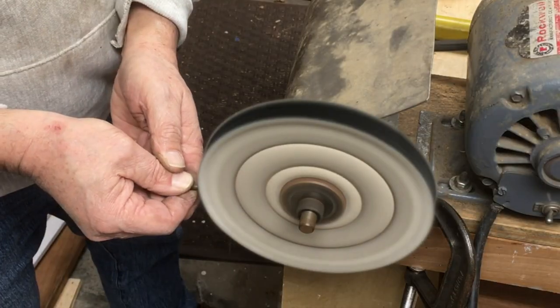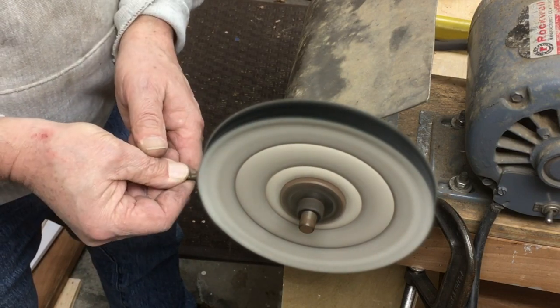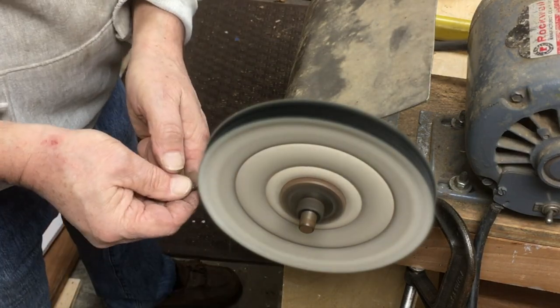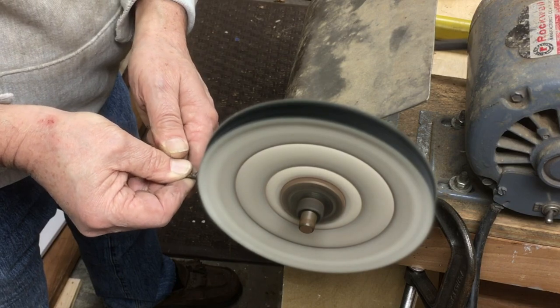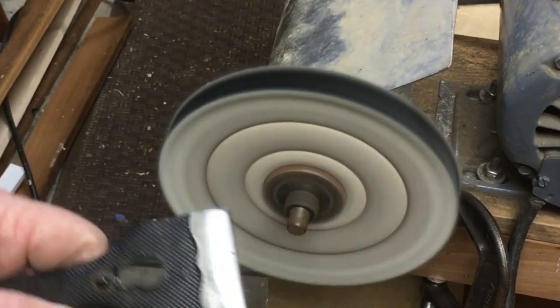But there's the screw that holds the knob. Again, you could get a mirror finish on that. I got a mirror finish on the two little screws that hold the frog to the body of the plane. Again, that was very easy, just a few minutes at 220 paper, then 400 paper, and then just a minute or two on the buffing wheel.